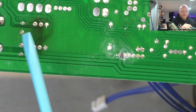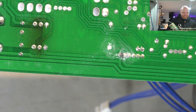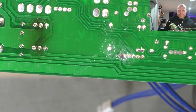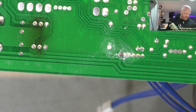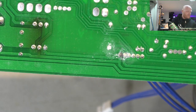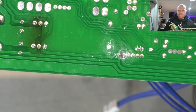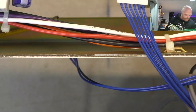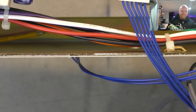They're Zener diodes. So once again, we have a manufacturer refusing to admit that linear regulators exist. So they're using Zener diodes in what were these things worth? $2,000? Linear regulators aren't that expensive. Anyway, so yeah, ZD for you Yanks, make you feel at home.